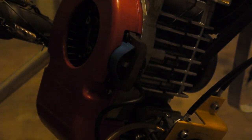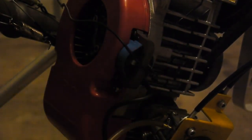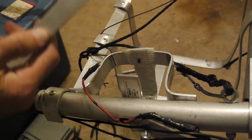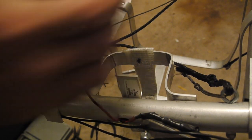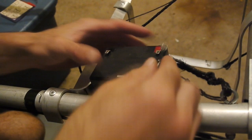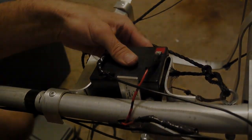This is my bracket that I made - it's probably an eighth of an inch thick, just aluminum you can find at any hardware store. I bent it, with one loop below to hold the battery in place and then a loop around it, and I just formed it around the battery I was going to use. I can simply slide this battery into place, then mount the positive here, take the negative and ground it to the engine itself. I also have a strap that goes over this so when I'm flying I don't have to worry about it flying out.